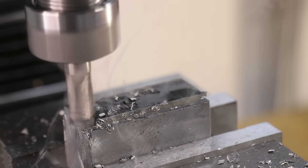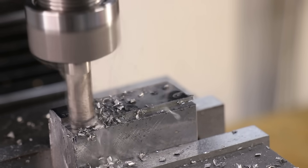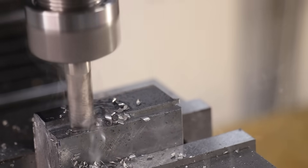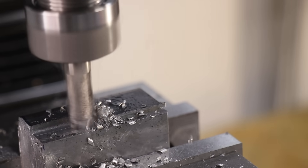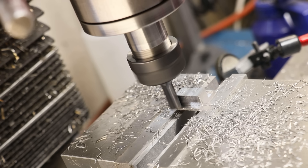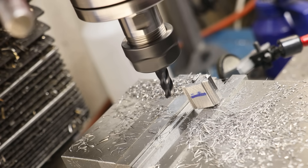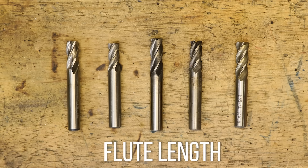Here's footage from about four years ago where only the very bottom of the cutter is being used whilst the rest of the end mill isn't being used for anything — it would be much better to do full-depth cuts using shallower step-overs. Obviously there are many cuts where you can't do this, but if you can prioritize it you get much better use out of your end mills. Just make sure to lock the table when doing particularly deep cuts — a mistake I've made far too many times — otherwise the end mill starts to climb-cut in the wrong direction with bad results.